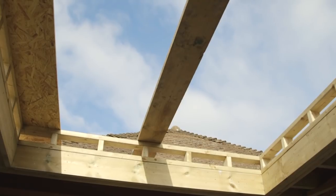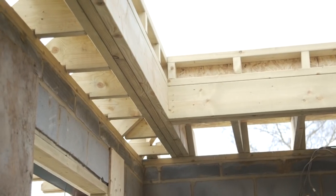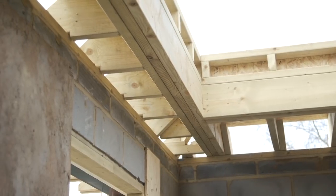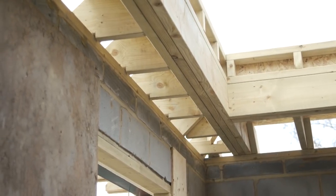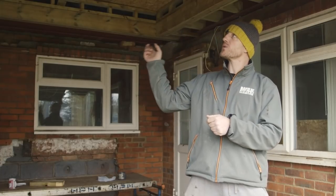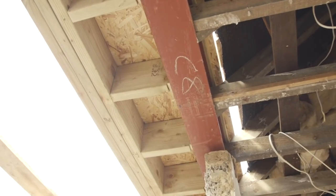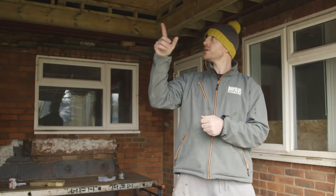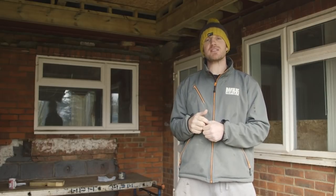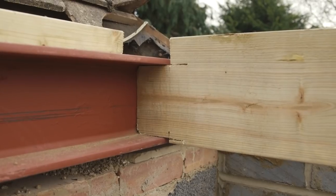We originally were going to just double up the roof joists, but rather than just having two, we've had to go three because of the strength — it's quite a big roof light, about three metres by 2.4. It's quite heavy, and because of that we've tripled up all the timbers around the opening to take the weight of the roof light. We've also finished off by putting some of the timbers from the flat roof into the webs of the steel, which just ties everything together, strengthens it, and obviously stops any movement.